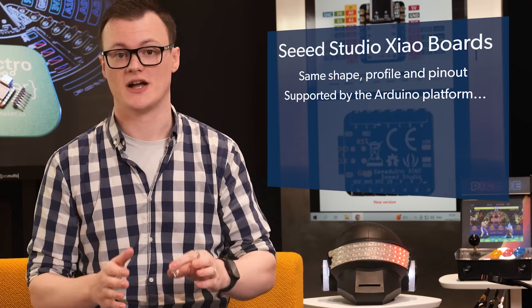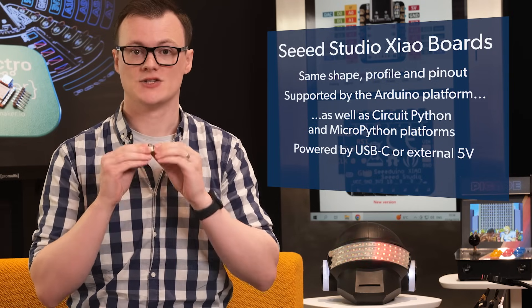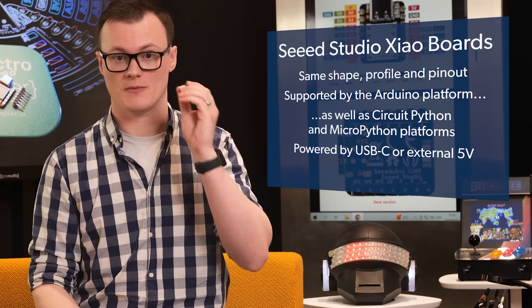There's no need for complex IDEs, dedicated software libraries, or sleepless nights trying to figure out how to use the hardware. The Arduino standard libraries bring a level of simplicity that cannot be matched. These boards also support the CircuitPython and MicroPython platforms, which also simplifies projects. With regards to power, these boards can be powered from either their USB-C connector or from an external 5V input. As all of these boards have the same 5V input, boards can be swapped around without needing to change the power circuit. Finally, the 3.3V source is generated on the board, so there is no need for an external 3.3V regulator.